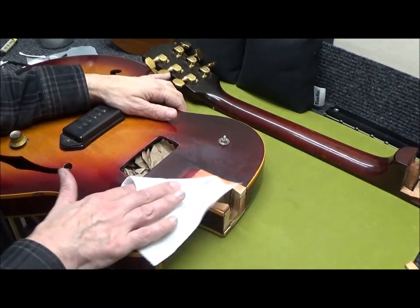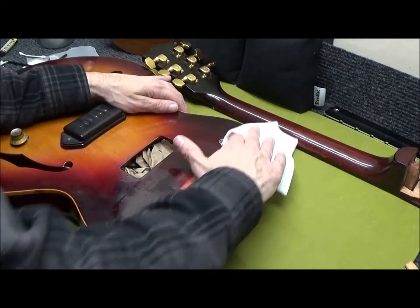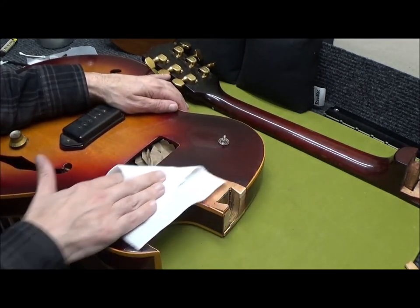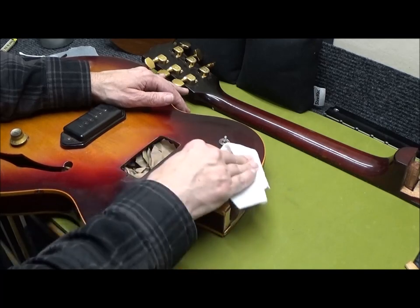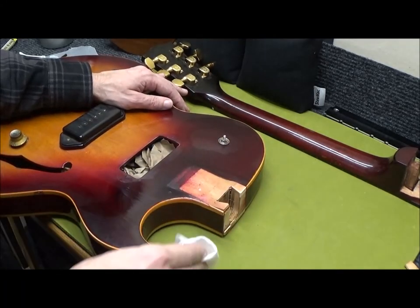That's wax. I started putting wax around the guitar body. Before I start running the steamer, I put this wax on there, and I kind of think it helps keep the lacquer from blushing. Anyways, I haven't had any serious blushing issues since I started waxing.